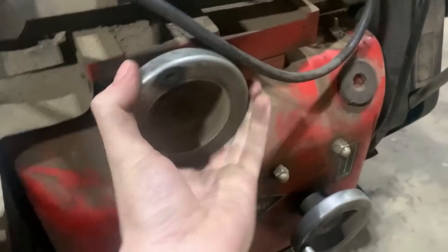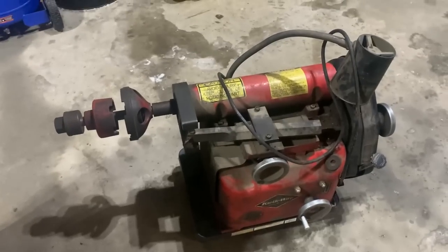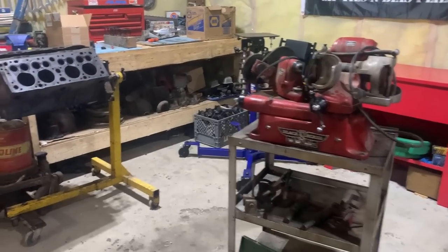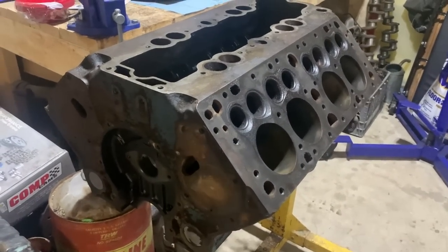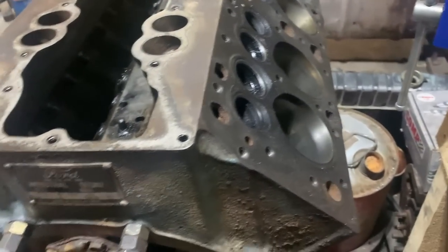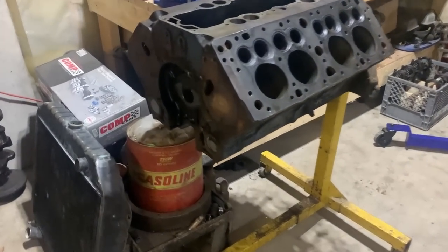What a nice little machine — I'll build a little cart or stand for it. It's compact, doesn't take up much room, and it'd be really exciting to do drum work as well. All this valve grinding stuff is going to come in super handy for the flathead revival project and future projects too. I've got all the valves out of this one and they all need cleaned up and ground, as do the seats. I'll have to go through my stuff and see if I've got the right size pilots for these guides and the right size stones for the seats. If not, I'll borrow or buy some — it wouldn't hurt to own more anyway. So we'll have the full setup for taking care of this right here.